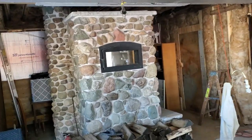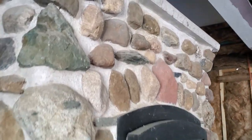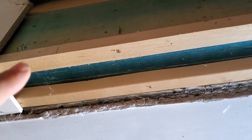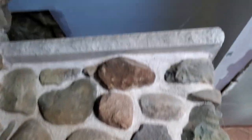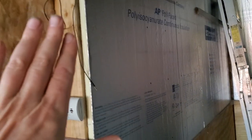One of the first things I did was install this beam here — three 18- to 20-inch LVL beams to take the weight of the second floor, which was originally on this wall. The stairs went up here originally, so the staircase opening was in the ceiling up there. I relocated the stairs over to this side.